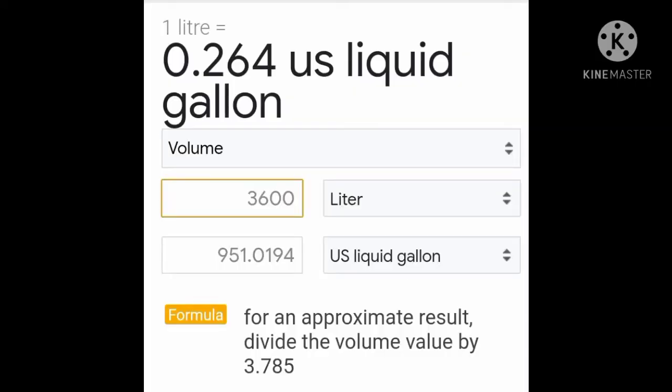Keep in mind that this was an estimate only. I filled up the bucket with 15 liters of water, then added a little extra on top because I knew it wouldn't be able to pump everything out. So at 15 liters in 15 seconds, that's about 1 liter a second, 60 liters in a minute, or 3,600 liters in an hour. So that's about 951 gallons per hour. That's not bad seeing that they stated it was an 1,100-gallon-per-hour pump. Give or take a few liters, I'm going to roughly estimate it and say it did do about 1,000 gallons per hour.